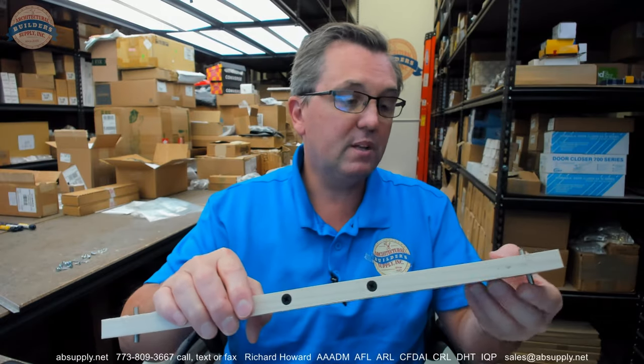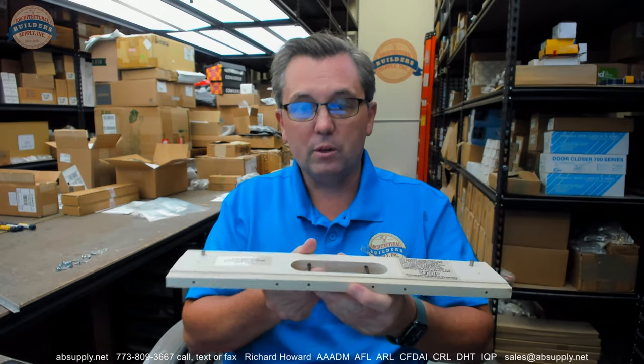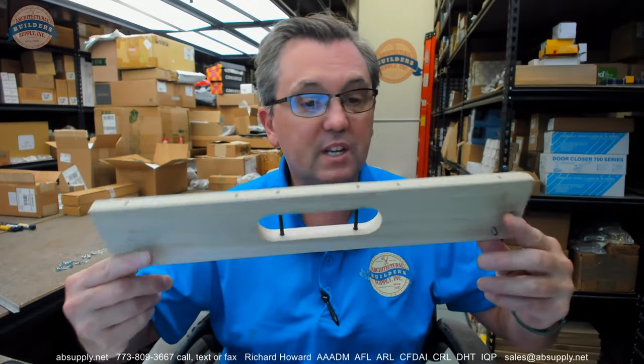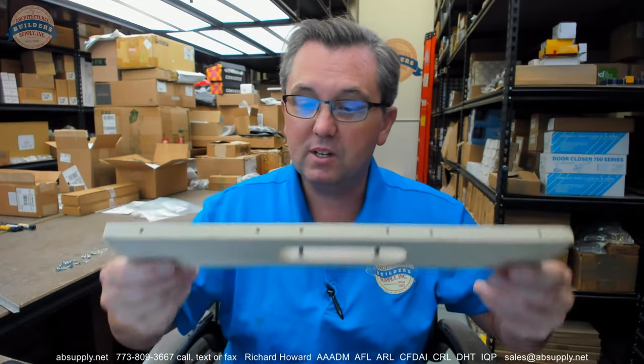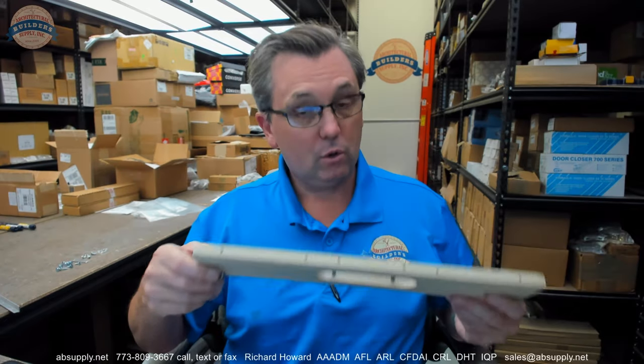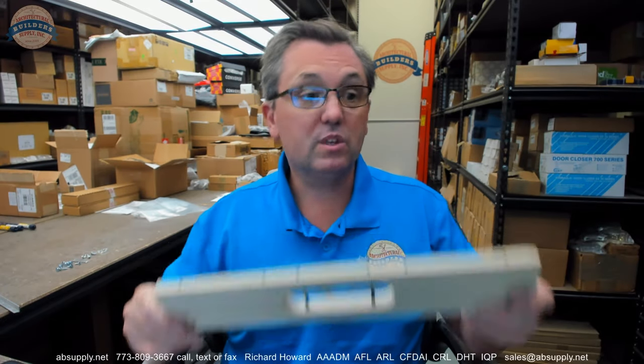Now, the locator pins are used when you put this onto the door on the pull side. You just push that up and you push it onto the door until it hits the locator pins. Now it's at the proper distance. And what we're accomplishing with that is a guarantee that you're not exceeding that absolute dimension not to exceed. The one do-not-do in the world of SOSS is automatically handled when you're using the 218 template with the 218 hinge. You don't have to worry about it. It might be 5 millimeter.